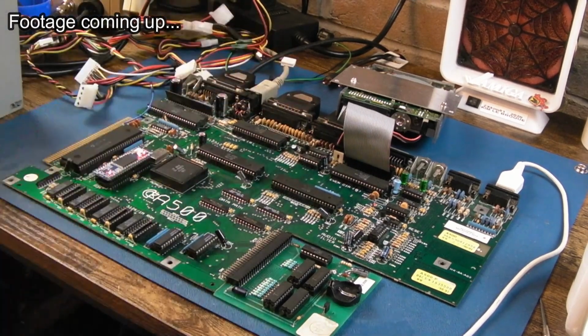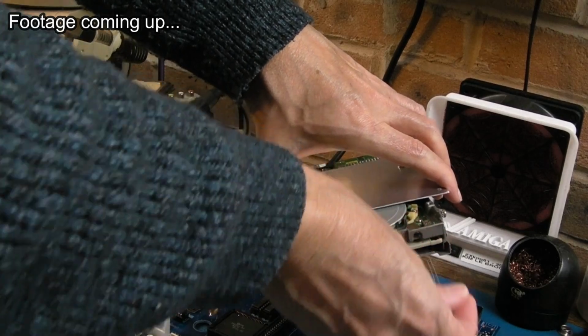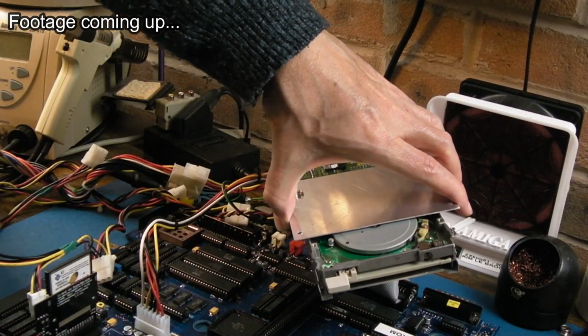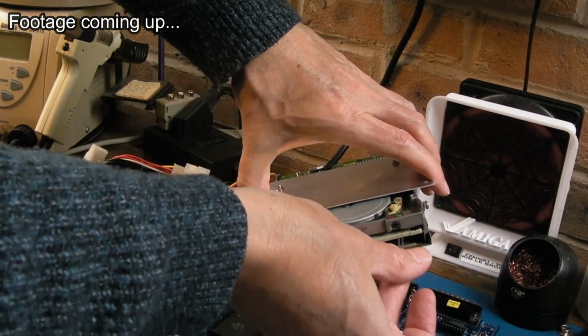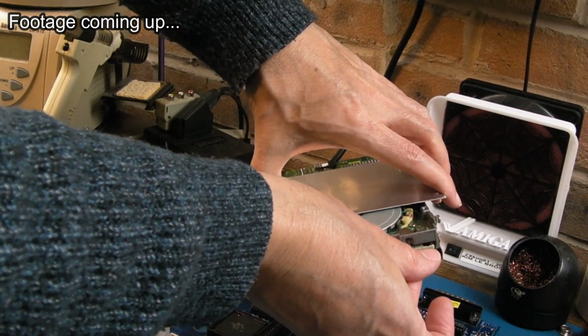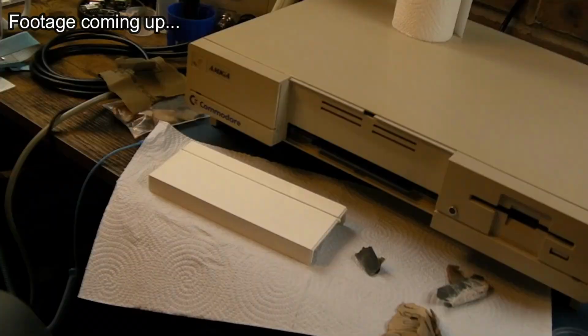We've now got the RAM working, it's running at the full clock speed. There's still some instabilities, there's still some interrupt issues which periodically appear. You'll see we'll resolve those in the next part as well. We also got the mouse fixed. Still don't, to this point in time, know why the mouse thing was resolved from a ferrite somewhere around Paula. Maybe a clock was not getting out of Paula, or maybe Paula would just have no VCC. That is one of the few chips that I did not check for 5 volts.